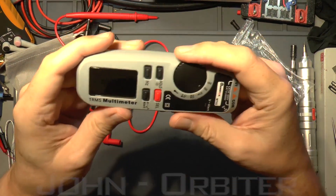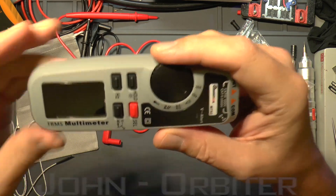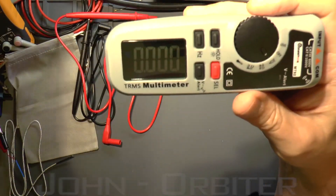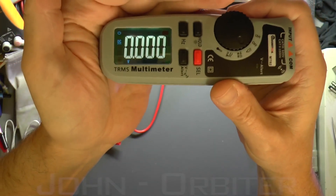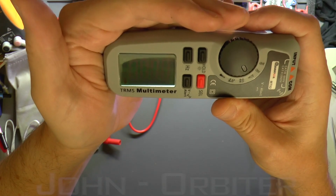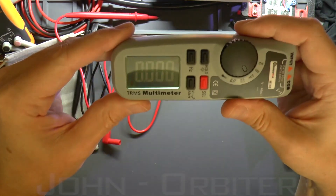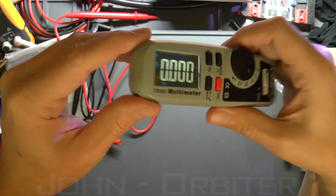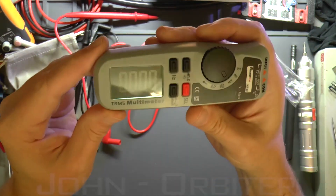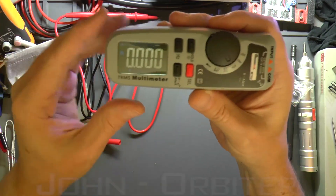Batteries in, and I'll dim the lights a bit — this display is a dark one. Turn it on — AC/DC — and it's illuminated on the black display, quite bright when you look at it from the front. It does dim off rapidly when you turn it sideways, as do a lot of LCDs. Side to side it's okay, but from the bottom there's one direction that doesn't work well — that's just how the screen layers are set up. Higher quality displays give more of a 180-degree view.